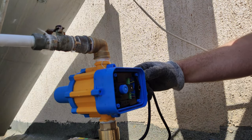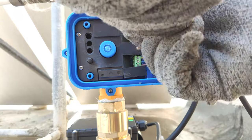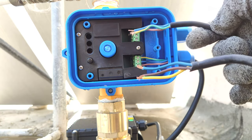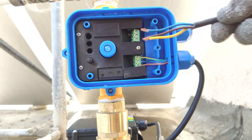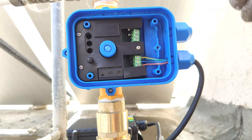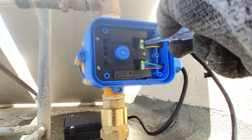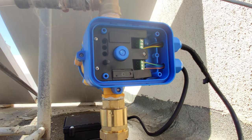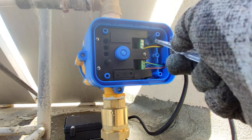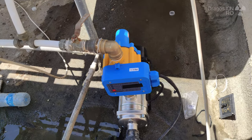Here I remove the old wires from the mains, the same as I showed you before. I compare the ones that I have on the roof there with the ones from the new pump - they're the same, which is perfect. I don't have to adjust them or trim them. Inserting them in this hole and I also put a bit of tape around the wire to make sure there is a bit of insulation there, because the new one doesn't really seem to have any water insulation around the cable. Inserting them the same as I showed you before, tightening them well with the electric screwdriver, also pulling them a bit after you finish to make sure that they are tight, because it might be that you tighten them but it's not closing.